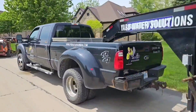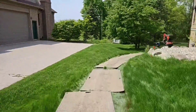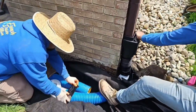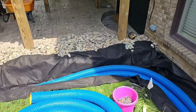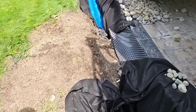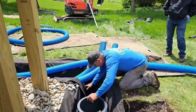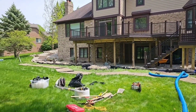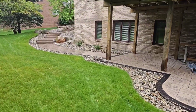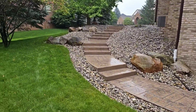We have a flat backyard with no slope. So many times builders and developers sell lots for walkout basements — they get a premium when they charge you for a walkout lot. The unfortunate part is so many walkout basements are built on lots that maybe should not have been a walkout. So we have a sump pump system with a lot of added chamber and we're really deep. Water was trapped between the sidewalk and the foundation of the home — this is a walkout basement with all the water running off the high ground.